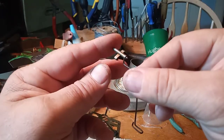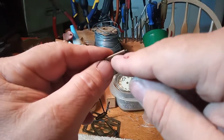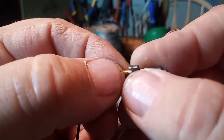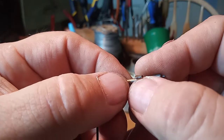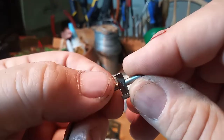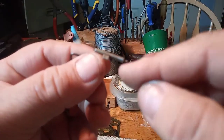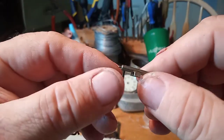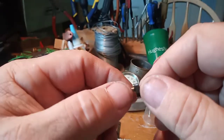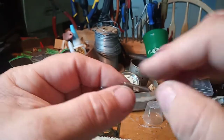When you clean up the clock you want to take a Dremel, a wet stone, or whatever, and make sure you get all the dirt and grime off both on this side and on this side. You also want to clean up the pivots. I personally use a Dremel with a wire brush — that seems to do a good enough job. I take the wire brush and clean in this area and in this area on both sides of the pivot.